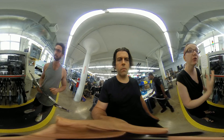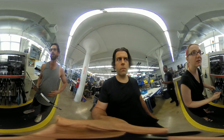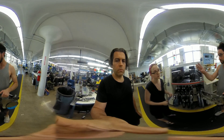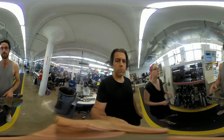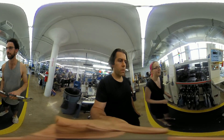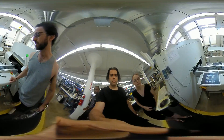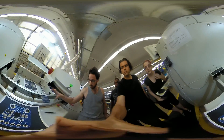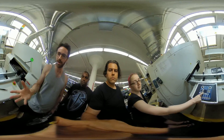Even though this is very automatic, you still need someone checking in, looking for complaints, running out of parts, or a feeder getting jammed. It's not a one-person job — this whole line really flows best with around two or three people at all times. Even without full automation, you still have to have the human touch. After this, there's the Workstation Conveyor — the board lands right here at our inspection station, where we can see if everything is placed correctly.